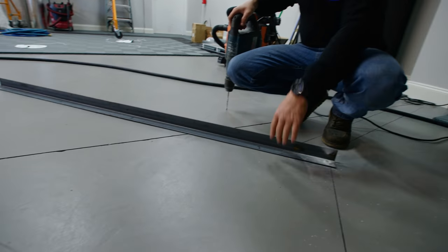If you didn't have a forklift, you'd need two floor jacks. And then you could do essentially the same thing, except that instead of using an eye bolt, you'd use a piece of all thread or threaded rod. Get a 4x4 or a 4x6 and straddle the cut on either side. Then put the 4x6 perpendicular to the cut. Drill a hole through it, get the all thread poking through it, put big nuts and washers on the top, and then you could use a floor jack on either side to jack it out of the ground. You'd have to pick a center point so it'd pull up together, because unless you had four floor jacks, then you could straddle two 4x6s or 4x4s, but that's how I'd do it.